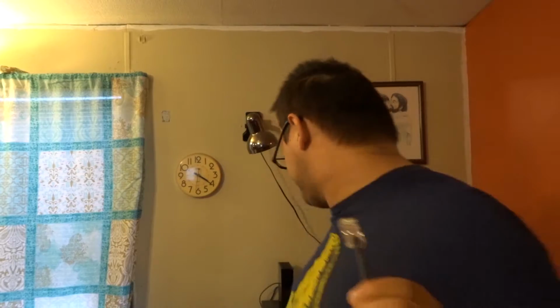Make sure you get the cables all the way up to the front, and then you're going to take your crimper tool, and we're going to take the RJ45, that's what these ends are, shove it in, and press it down. And you'll know you've done it correctly because you won't be able to pull the end off. Now all we have to do is do this on the other end, and we should have a cable.